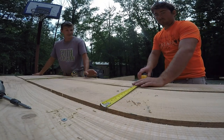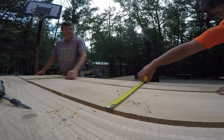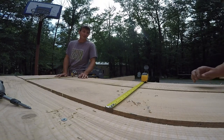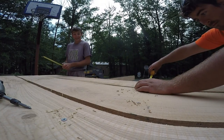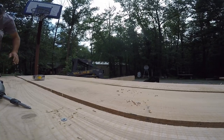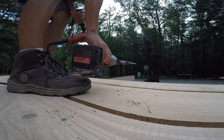We're making it up as we go. Square bales don't care whether it's square - as long as they don't fall off. We're leaving a varying gap: seven-eighths, three-quarters, one inch - it's all over the place. It's ash, it's very hard, so we've been pre-drilling. We have to pre-drill; I've already broken a few screw heads off.